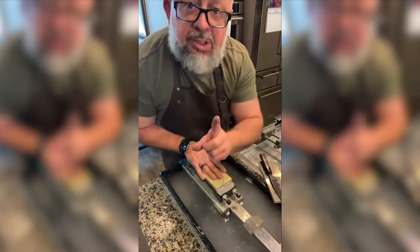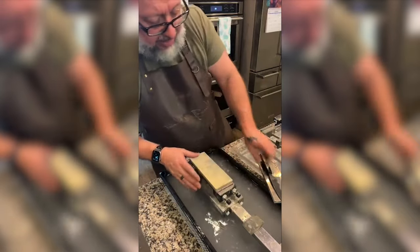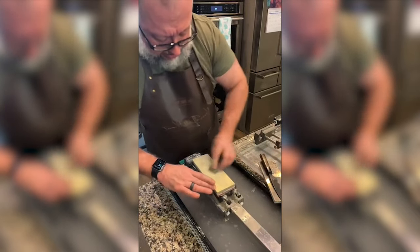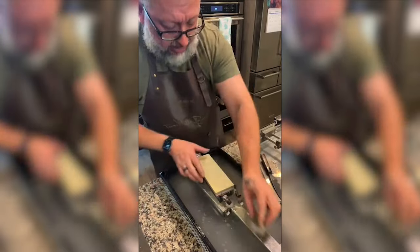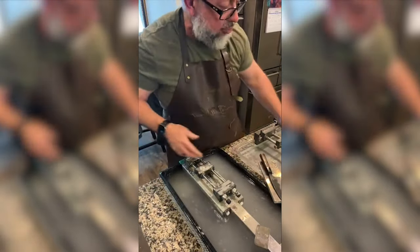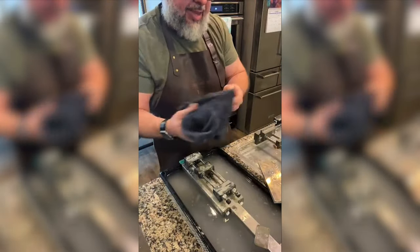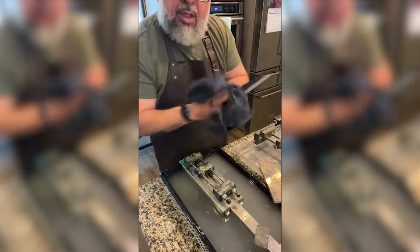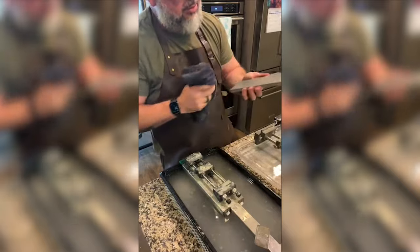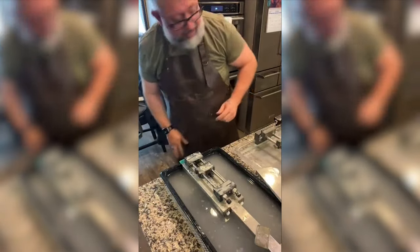All right, so we're only going to be polishing one side today. That's what we're doing. So this has got to get cleaned. I don't want to put stuff away dirty. We also need to make sure that we do not take particles onto the knife. So we're going to clean the knife to make sure that nothing from the 200 grit goes with us. We need to make sure the Atoma is clean, so there's no particles on the Atoma. Thumbs up if you agree.